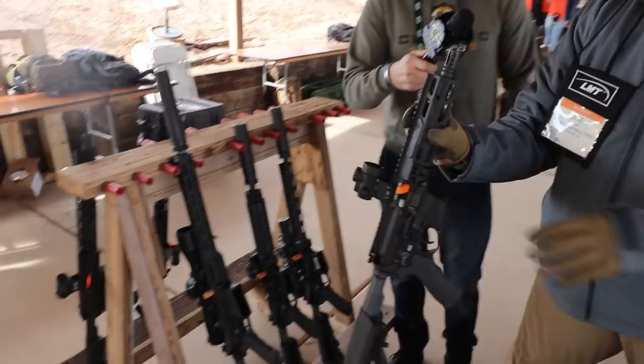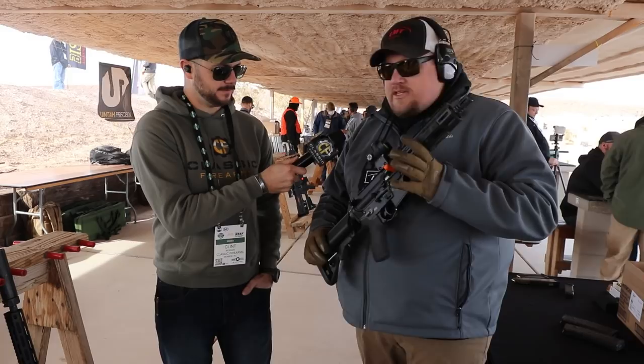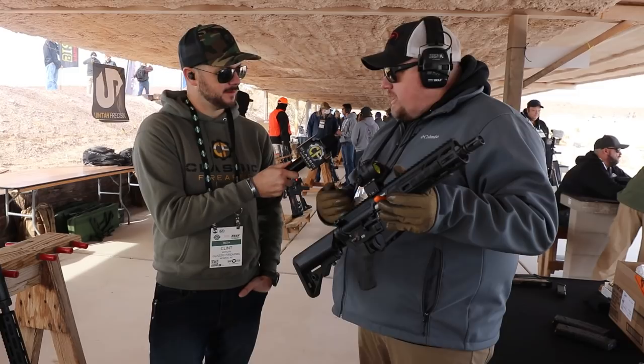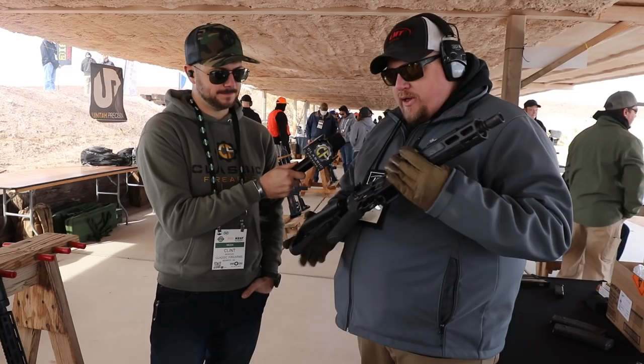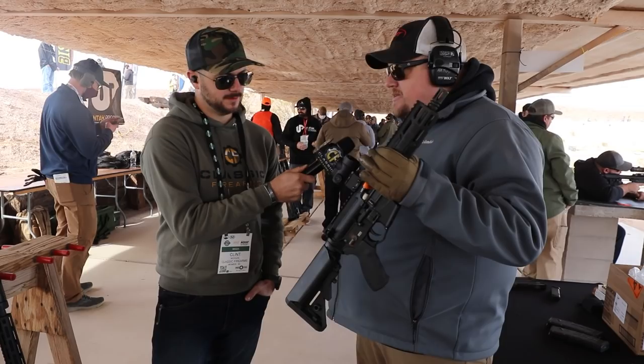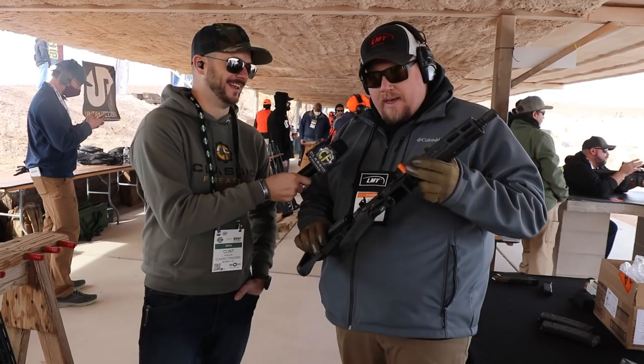This one here has had a lot of internet hype around it. A couple years ago the Army released a tender wanting a 9mm submission, so we put in our submission. This is a piston-system 9mm, still runs your standard piston bolt carrier group with a little tappet and a rotating bolt. Full ambidextrous controls, monolithic upper. You'll see more calibers in the future where you can change that barrel system as well. It's a very nice little compact system that runs really well. This one's set up for Glock mags — that's for an international tender. Gen 2 will come around soon hopefully with a double-stack mag platform.